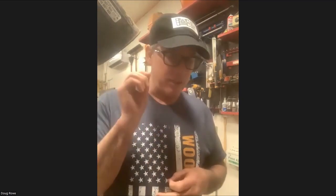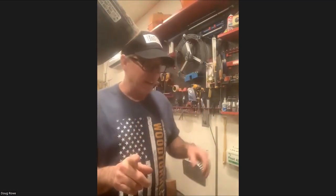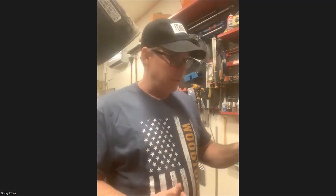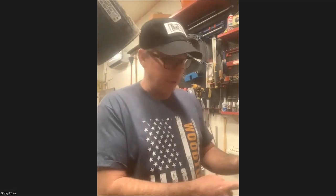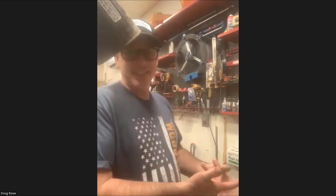And then I saw Doug Miller's on, right? I think right when I popped on, Doug Miller was showing his gallery. So Doug Miller, you saved me in another situation that you don't even know that you saved me on. It was your idea, or I got the idea from you, to quit taking my chuck off every time I need to put my spur drive in, just stick the spur drive in the chuck. And I've been doing it that way ever since you showed it to me. Well, then the other day I'd been using my vacuum chuck and I told myself, don't forget to disconnect that, otherwise you're going to have troubles later. And I forgot to disconnect it and I'm using my spur drive. And I went, oh no, and then realized, oh, but it's inside my chuck, so I'm okay. And I just took the chuck off. So thanks, Miller.